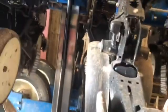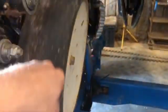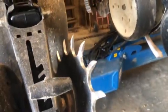We had a lot of trouble with the planter. We grease this thing every 300 acres. Well, we might grease it every 350 acres, every 250 acres. When we get a chance to grease it, we grease it. But these bands right here, these wheels, you cannot keep these things in bands. Bands are always going out. These roll cleaner bands back here are always going out. And these are spike wheels, they're alright, but anyway, these are your spike closing wheels.